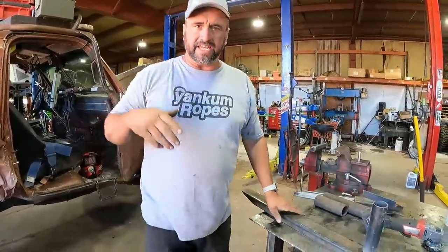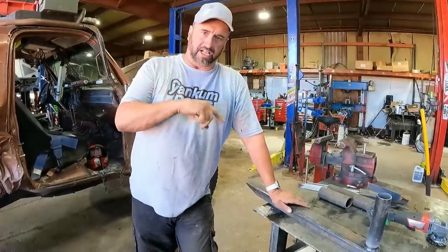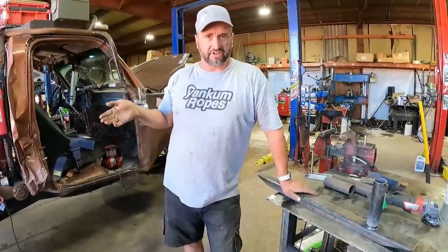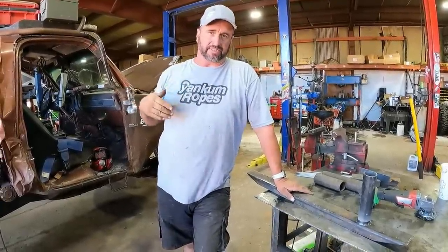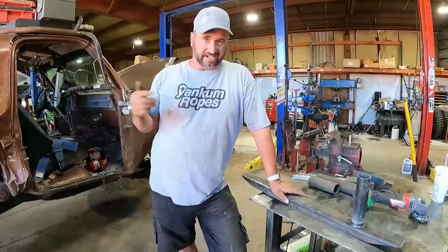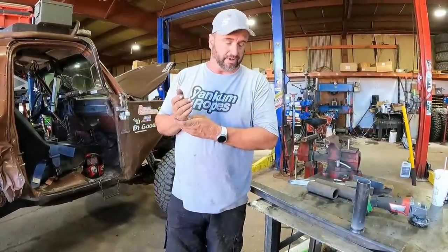The only thing you've got to watch out for is the welder doesn't charge the battery while it's welding — it only charges when it's shut off. That's also another reason why I don't run an electric fan. I run a mechanical fan so it cuts down on my power draw while I'm welding. I've got dual batteries and I can run my lights forever, but it's one of those things I plan ahead for.